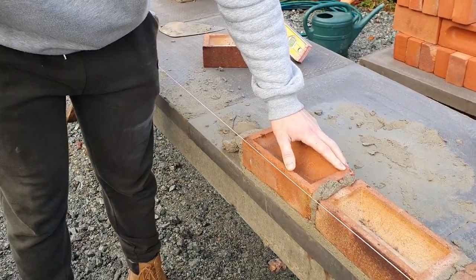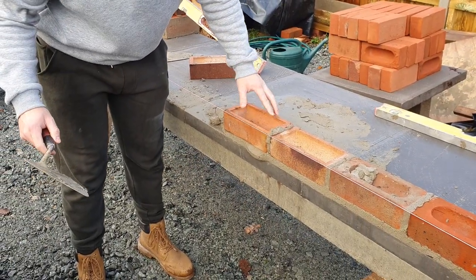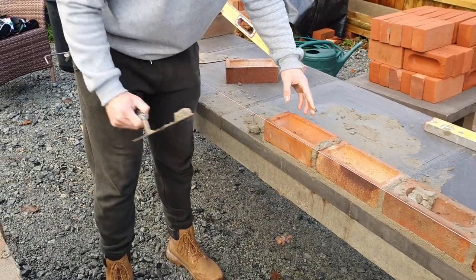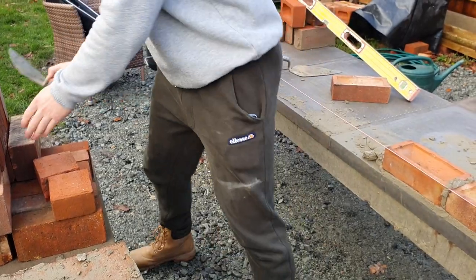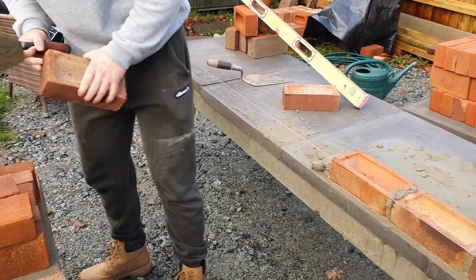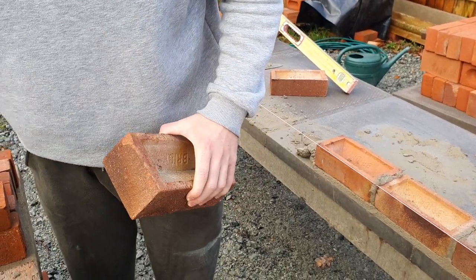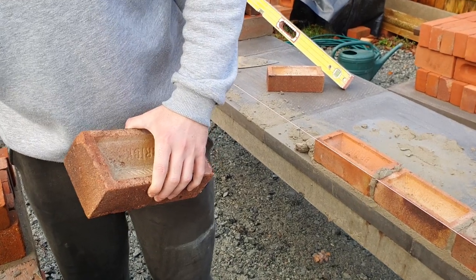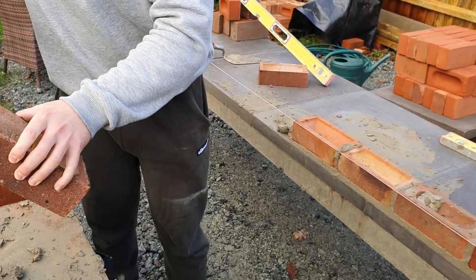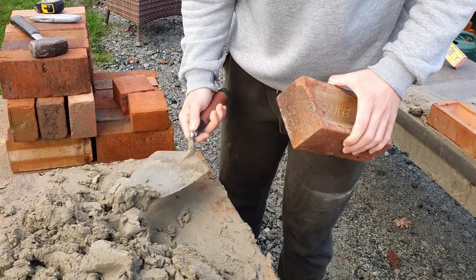So now straight away, look, your brick is just tipping back. Don't worry, just carry on. Just lay it and leave it, then we'll think about your next one. You're looking to get an equal bed, and so you just lay your brick on it. As I say, that first to second gear is the hardest bit, isn't it? When you're driving, this is exactly the same, trying to get from first gear to second gear. It slipped off the brick.